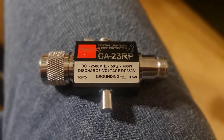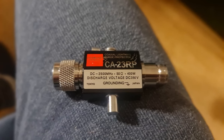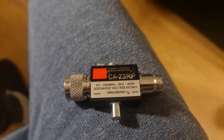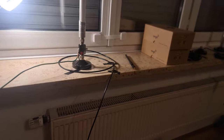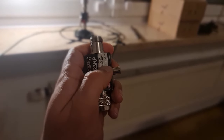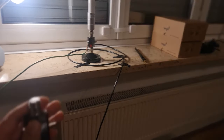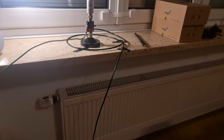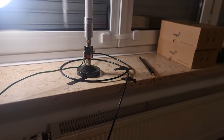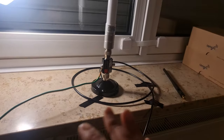If you don't use a lightning arrester, be careful — there's a high risk of burning your house or your host's house. A lightning arrester will not protect you from a direct lightning strike. If lightning hits one to two kilometers away, the electromagnetic wave will trigger the gas inside and protect your electronic devices. But if lightning hits your antenna directly, the antenna, house, miner, and router can all burn. A lightning arrester only reduces the damage from nearby wave propagation — not a direct strike.